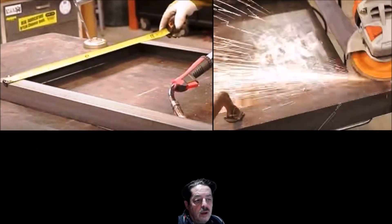Let's take a look at the one on the left. Let's say you finished welding it and you're done — let's check one more time. I use a tape measure and measure my length and width on each end to make sure I've actually welded this thing nice and square. This is another way of checking your squareness to make sure you've welded it up correctly. You can use a tape measure for that. Now, what do we do towards the end when we clean up our welds? He's using his 4.5-inch angle grinder with a flap wheel — probably 60 or 80 grit — taking the welds down so it comes out nice and flat. This is one of the final steps: cleaning up your welds.